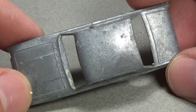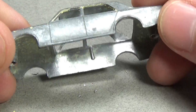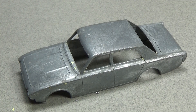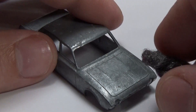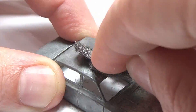Removing the paint, I can see that the car only has some light oxidation. The enamel paint did a good job of preserving the metal of this car. There's no real need to electropolish this body; instead I'll just go over everything with some steel wool. This does two things: one, it removes the oxidation and any paint residue, and two, it leaves tiny scratches on the surface for the paint to grab onto when I paint it.